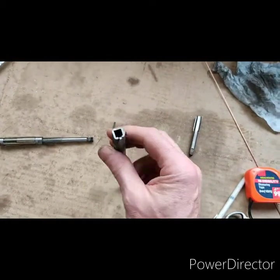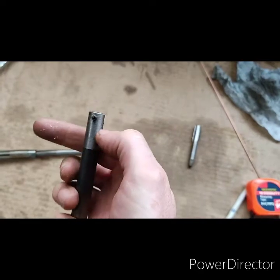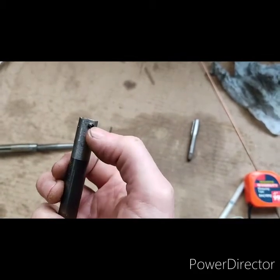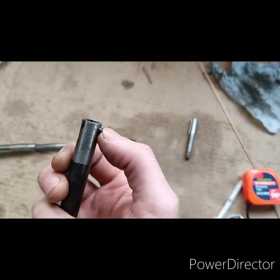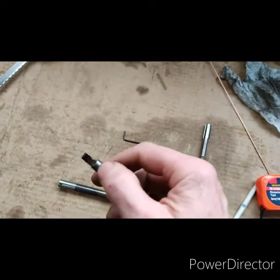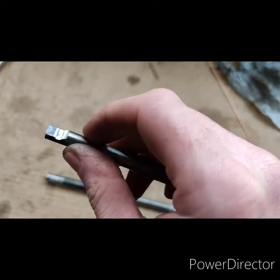Because there's not an awful lot of meat across the flat, I took my MIG welder and welded excess metal back on both sides for strength, then turned it down in the lathe. I then drilled it out to 3.3mm, tapped it, and put an M4 grub screw in. To give the grub screw a bit more bite on the reamer, I ground a flat onto it, and you can see the little mark where the grub screw catches it.